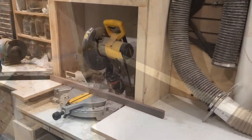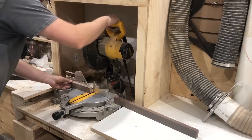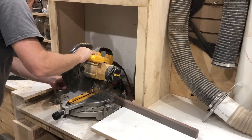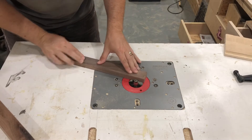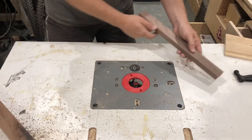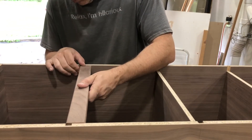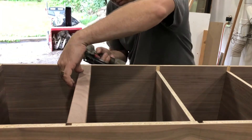This is the finished interior portion of the cabinet. You'll notice there's a dado or groove that's exposed — and what am I going to do to cover it? I'm using solid walnut scraps — material I was actually going to use as firewood, but I found a better home for it. I cut pieces to length and rounded the edges over, because it's a shelf and you don't want sharp edges. Once I put them in, it's all walnut so it matches perfectly and covers up the exposed groove spots.